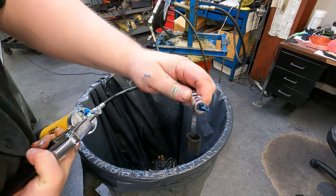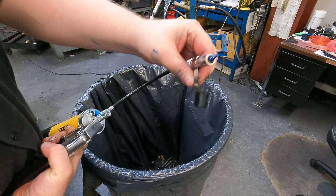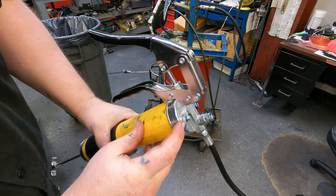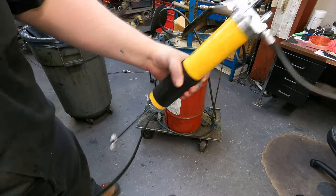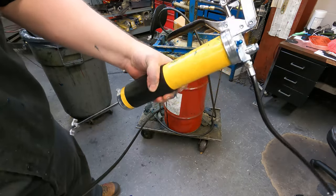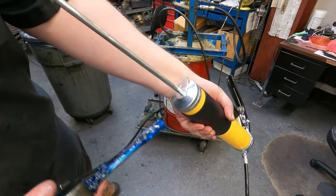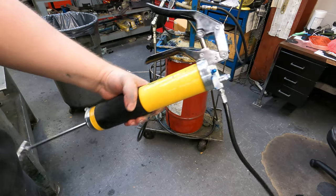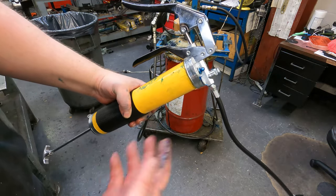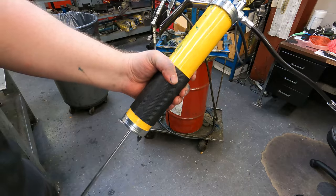You can keep this cap on here if you've got grease dripping — just put the cap over it. Now you can see we've got this Zerk on here. When this thing gets low, I can just pull that handle out, stick this on here, and fill it up like that. The danger there is, of course, if you overfill it, you'll blow that seal up and you'll always have grease coming through the back. The only way I fill up a grease gun is the way I just showed you: take the lid completely off, fill it from the bottom up, then put the lid back on. That way I can ensure I'm not blowing up that seal.